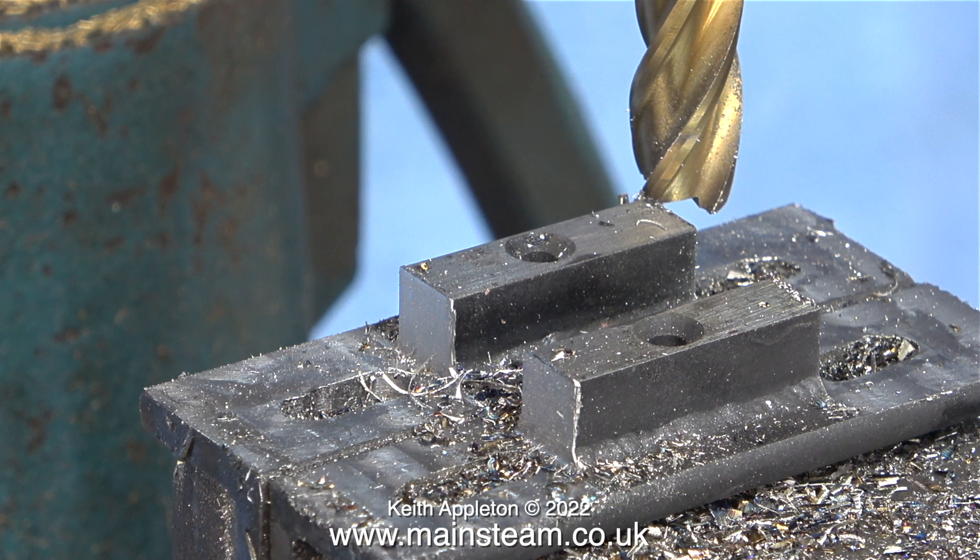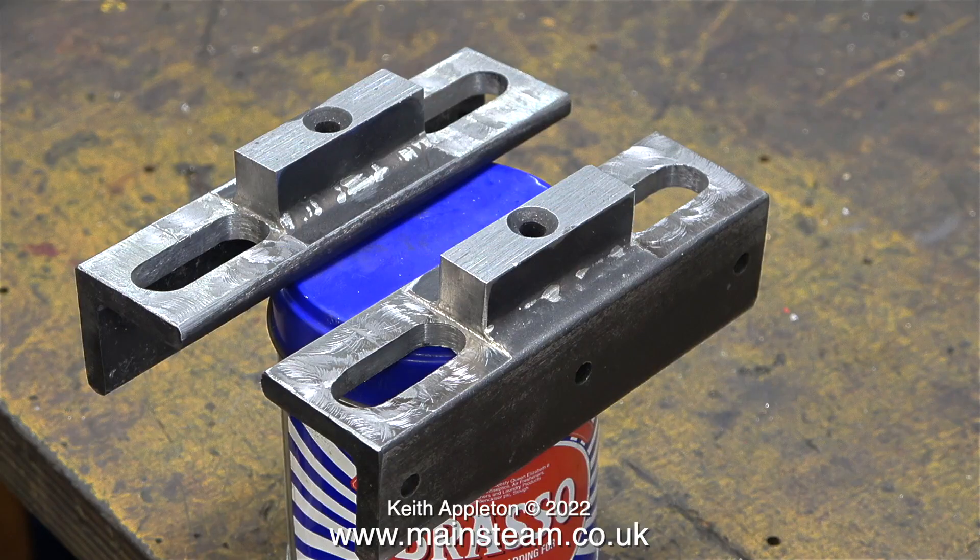Using a 5/8-inch diameter end mill I removed all the horrible bits that you've just seen me working on. Because the parts were clamped together in the machine vise — this time without any packing because it's not needed — the parts were much more accurate than they were in the first place. Although the slots are not all the same as each other because I followed the original holes for position, this really doesn't matter because I am making a flexible fixing. What I need to make are some parts that travel in the slots, which allows for the contraction and expansion of the boiler.